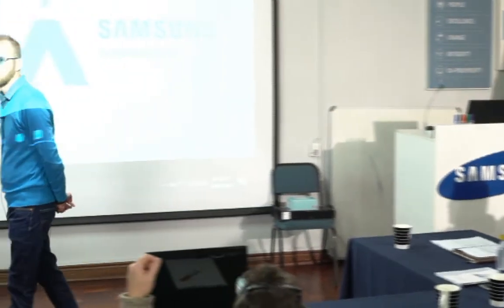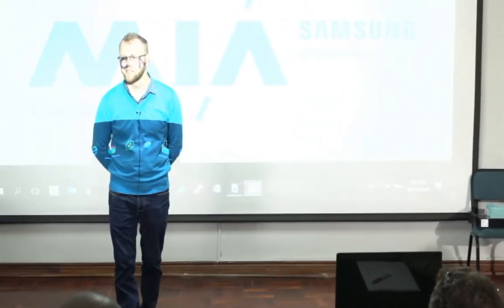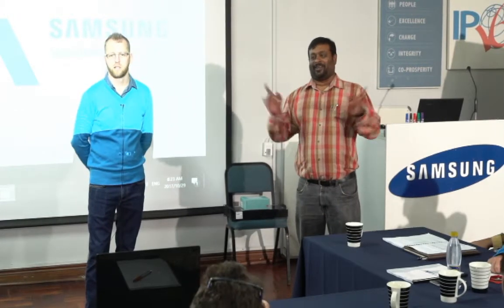You got the training manuals yesterday. So if you had some time last night, you would have seen in the manual it shows how to log into the device and activate all 8 ports for PoE. Because by default it will only be 4 ports. It doesn't matter which 4, the first four will always work. Plug in, it needs PoE, it gives it to you and gives the others out. Ask him next to you. He drove back to the office with the switch one day to say it was faulty.